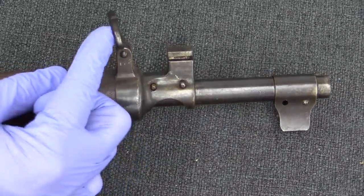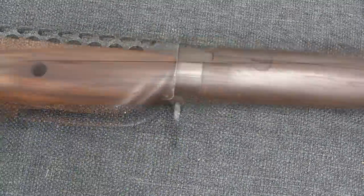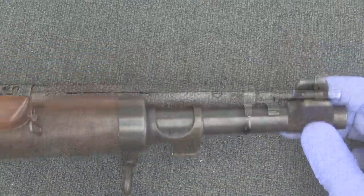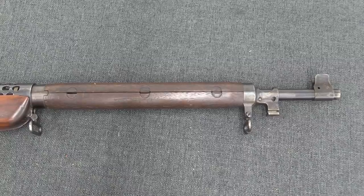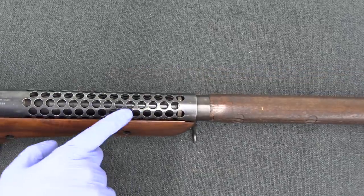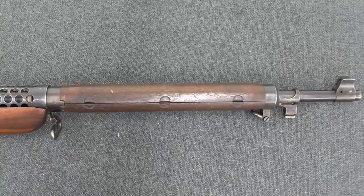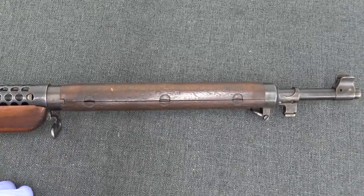It's a little bit interesting that they went ahead and put a sling swivel out on the front of the bayonet, given that there was already a sling swivel on the receiver to go along with the one on the buttstock. But I suppose that gives someone the option of how they want to configure the sling. One very real argument against this whole thing is that part of the design intent of the Johnson was to allow the barrel to cool very well by having the whole barrel exposed. You can see the perforated front receiver shroud here allows airflow through to the barrel. But you put a handguard on it like this, and you're trapping a lot of that heat inside the handguard. Ultimately no one ever adopted the gun with this sort of handguard on it.